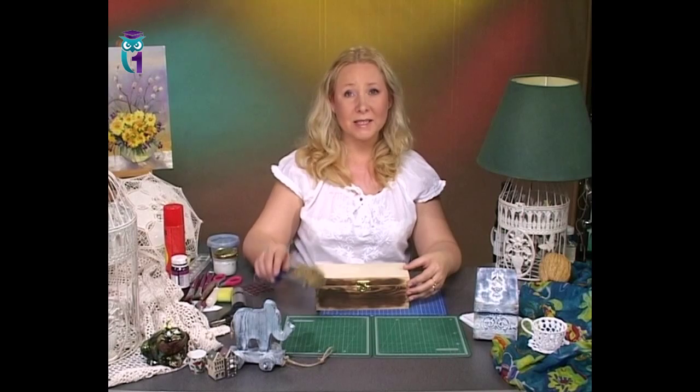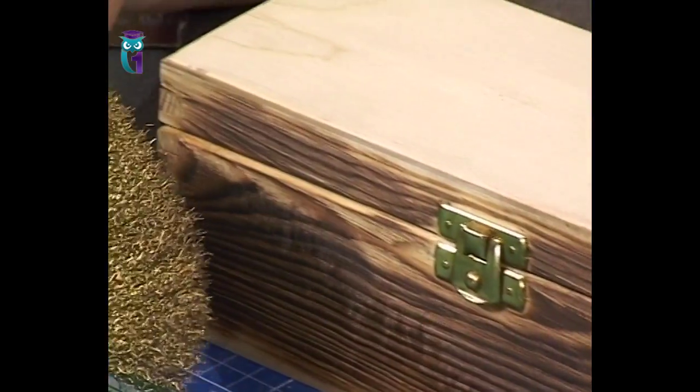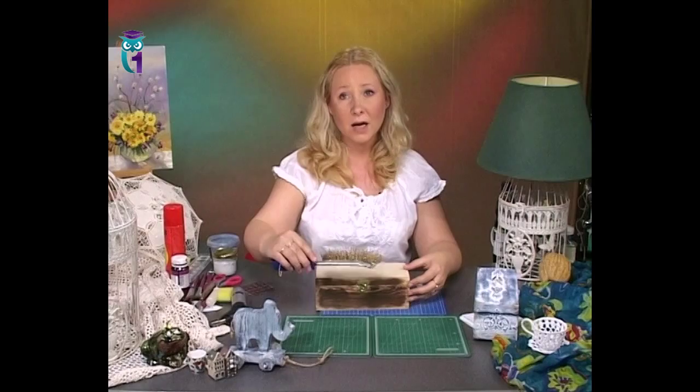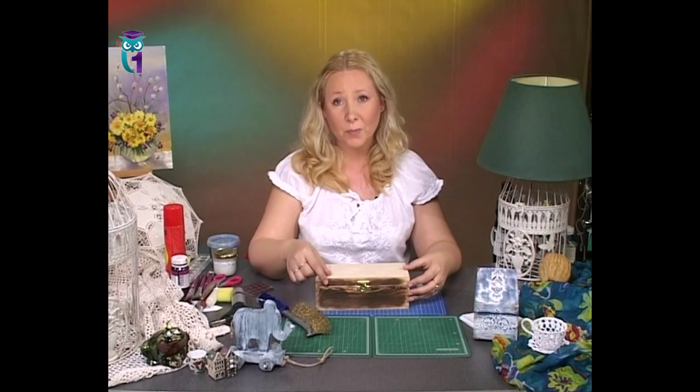If you have roasted your casket, you can take a special steel brush and with its help clear the burnt wood of coal, which has turned out in the combustion process. We work with the brush strictly along the fibers. Another variant isn't acceptable. If we hold the brush against the wood fibers, we won't get any pattern and will just scratch the product. This process is called brushing instead of roasting. Roasting is an independent method. In our variant, we have combined them together.